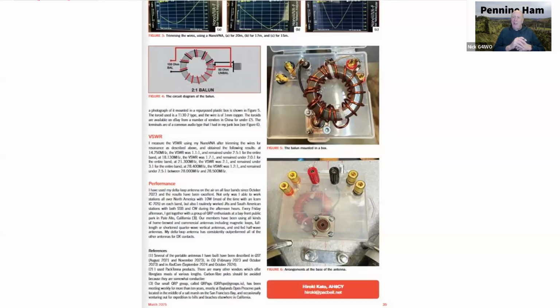And I know as well DX Commander in the UK are now selling their poles through DX Engineering, and they've got poles of a similar rigidity to the Spiderbeam ones. They're quite heavy duty, very thick poles at the bottom, so the amount of bend in them isn't that much, and that's why both Spiderbeam and DX Commander are using those poles for vertical antennas, because of the greater rigidity. Even when there's a lot of wind blowing on them, they don't sway quite as much.